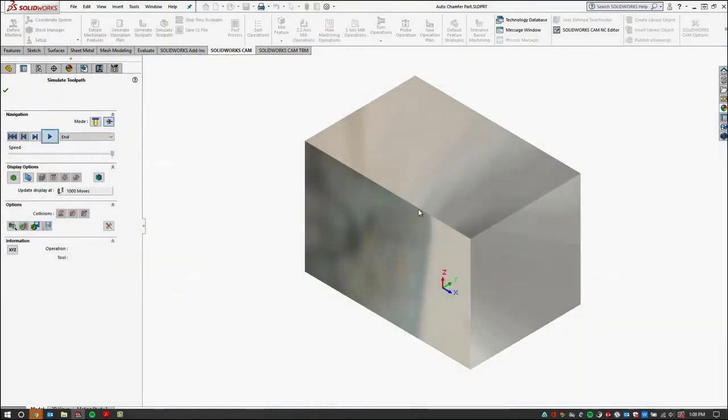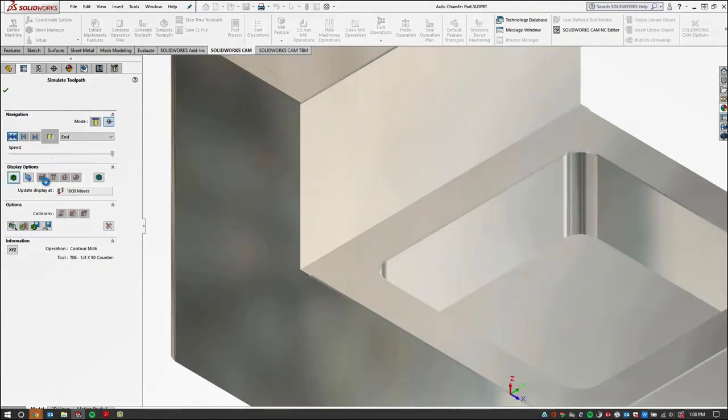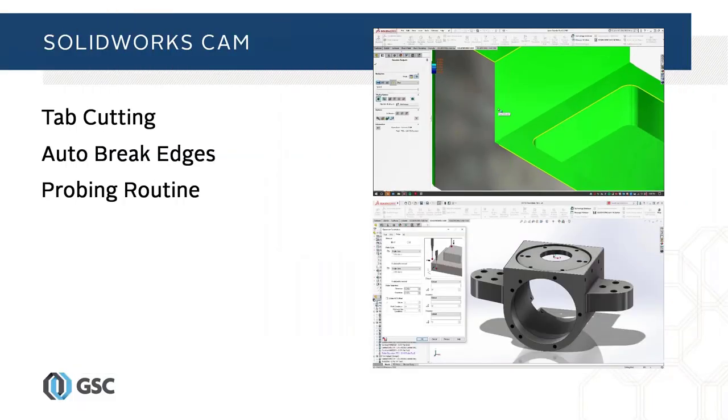it'll walk away if it comes to a right angle corner, like down in the corner there. So you can see it goes through and then pulls away a little bit and does all those horizontal edges from the point of view of the toolpath, which is exactly what you want to do in many cases. So I don't even have to really create a chamfer toolpath. I just say, hey, look at this and do it for me, and it does it. That's a very SOLIDWORKS kind of enhancement, right?